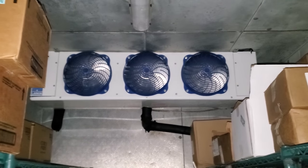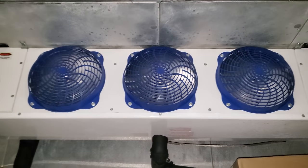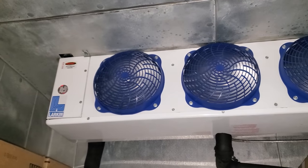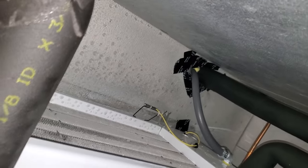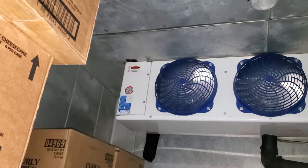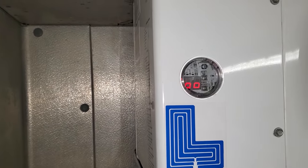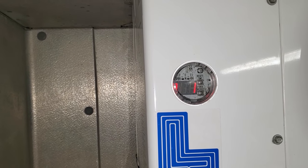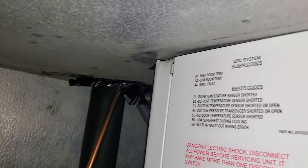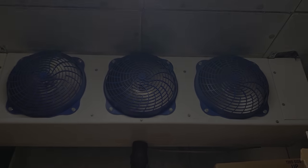Alright, it's Wednesday, July 21st, 8:16 PM. Got an emergency service call — a walk-in freezer not working. Pretty cold in here. The coil's not iced up. Everything's running in here. This is a QRC board. The QRC board says cool, 13 degrees, and A1, which is high room temp. So it's obviously been shutting off throughout the day, and it's probably running now that it's cooler outside.